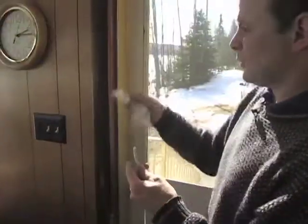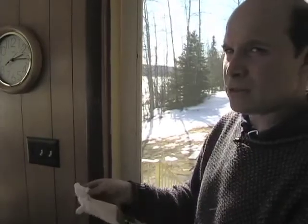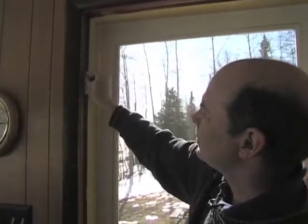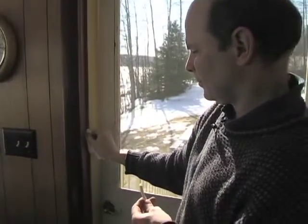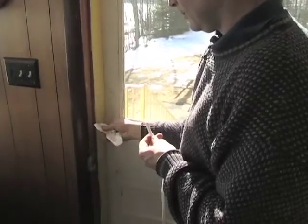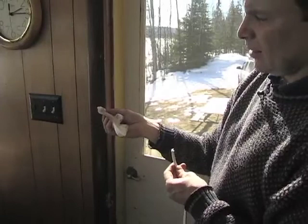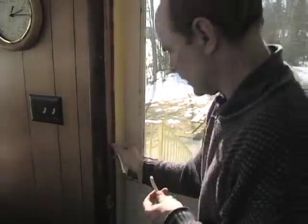I'm going to go ahead and first wash the surface off with a damp napkin and then wipe it with the dry end just to make sure that dust, cobwebs, other things that may have developed come off clean. You can see the accumulation right here. That would inhibit the ability of the adhesive from sealing well.